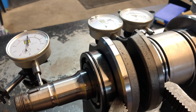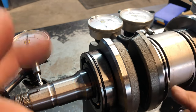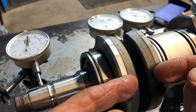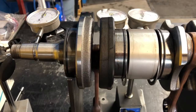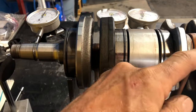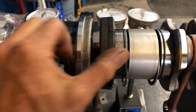To check the spacing, I put the rod facing me — it's a thou on one side and over a thou on the other, so that's where my two thousandths is. It's either pinched in or too wide. If it's too wide, this will move this way — and that's exactly what it did. To show you the difference, I'll just give it a little pinch with the pliers and you can see it goes down to zero. So the correction I need is just to pinch it in.